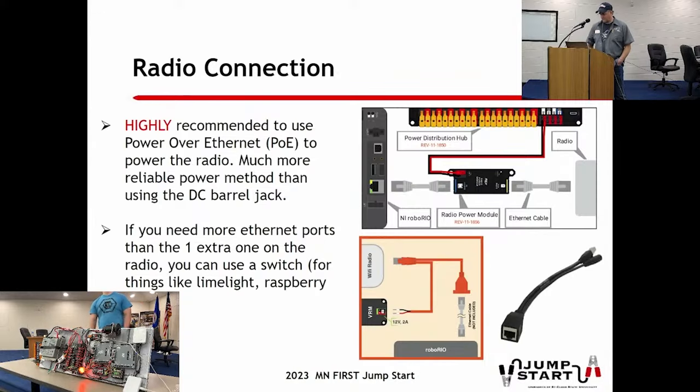There are a couple different ways to hook up the radio. The REV option connects Ethernet cables for power over Ethernet - that is the recommended way. A previous method used an orange cable plugged into a CTRE VRM or similar device to inject 12 volts into the POE cable. These work but are not recommended because they add more failure points: you have to wire the VRM correctly, and some POE injectors are shaky internally or not manufactured to the best standards. We do generally recommend power over Ethernet when possible and have had good luck with the REV units.